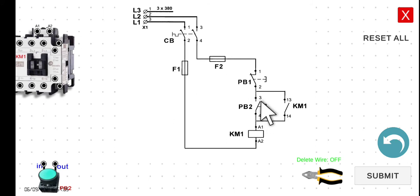Although if you release your hand from PB2, the current will not be able to flow through that path. However, since the current is also flowing through the holding contact path, this A1 and A2 — the coil of our KM1 — is still in an energized state. So how do we turn it off? We have to interrupt the current flowing here. So we can de-energize this one by pressing PB1. If you press PB1, the current will not be able to flow from this line to this line, and hence this one will return to its de-energized state.